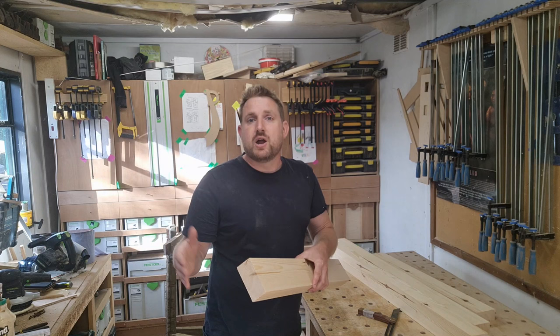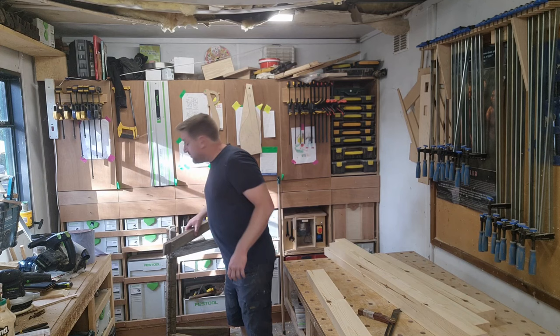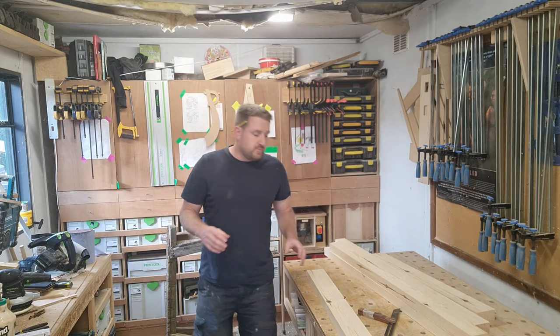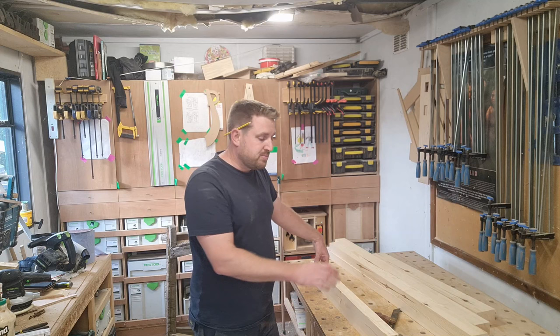Then we'll plate it. And you can see here, I've taken my old sawhorse apart, and you can see what we've got to do to the legs. We're going to do a 1/2 inch housing on the top to start with. So it's fairly simple, but I'll bring the camera in now and we'll zoom in and show how we're going to lay this first bit out on the top for the housings.